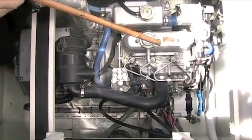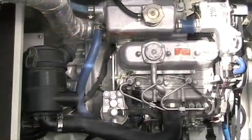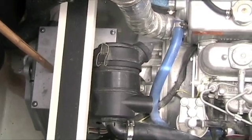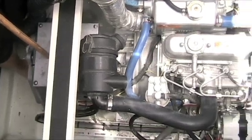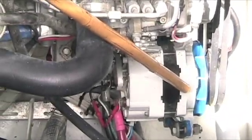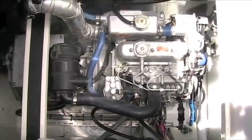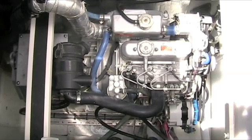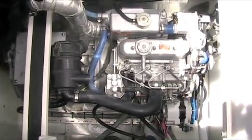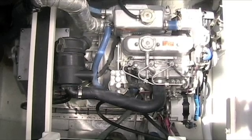This gen set consists of a smooth running three-cylinder fossil fuel engine, the generator back end that sends 240 volts AC to the drive motors and battery chargers, and a high output alternator which sends 12 volt DC directly to the batteries. For redundancy on Harmony, we have two generators. Catamarans typically only use one motor when power voyaging. Although two might provide an extra knot of speed, they decrease overall fuel economy, so each generator only has to support one drive motor, making it smaller and using less fuel.